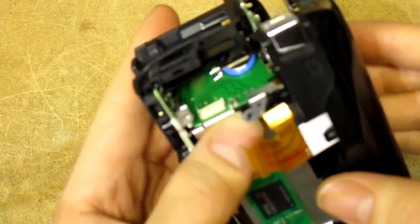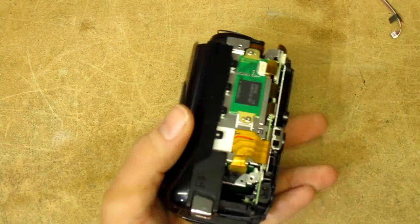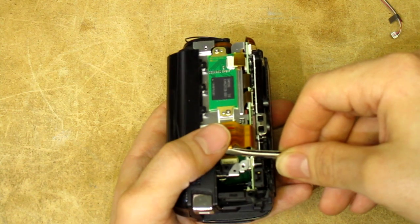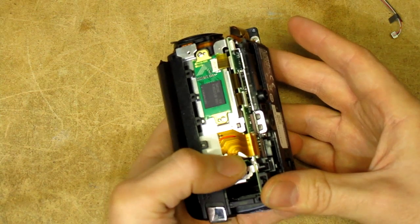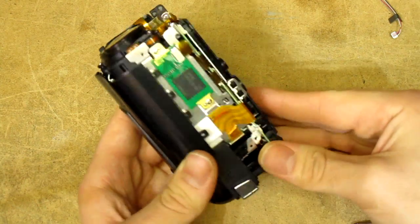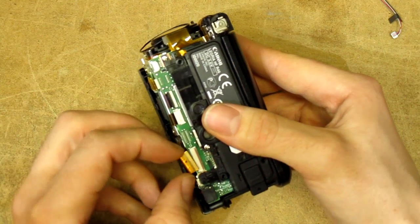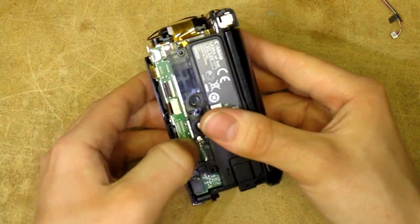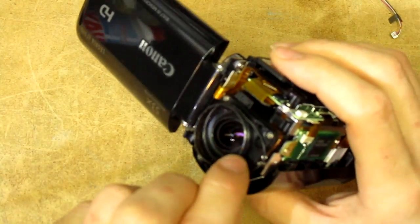I don't need to install it too properly — mostly just need to get the flat flexes in. I hate these non-ZIF flat flexes, they are devil's work. This is one of the worst ones too since you don't even get any proper place to push it in — you just have to bend it and force it, really risking breaking it. Definitely don't want to disconnect that any more than necessary. This is a proper ZIF socket though — it should just slide in with zero insertion force.